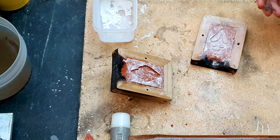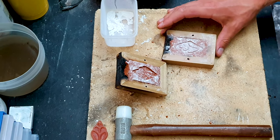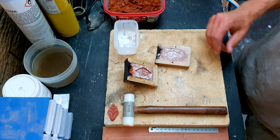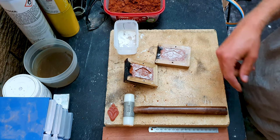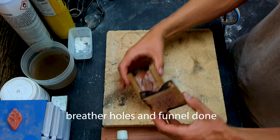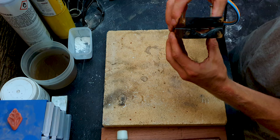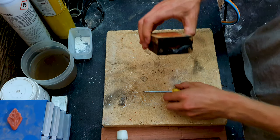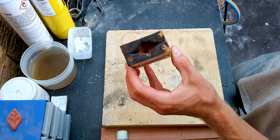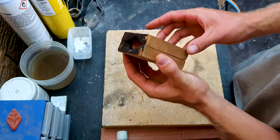The top end, put that over here — so that's my two halves of my mould. The next section is to put in my breather holes so that once it's poured in, the air has somewhere to go and it doesn't suffocate itself. Then a little funnel to be cut out at the top so it can be poured down from the top. Place these back together gently. You can see the little funnel hole and breathers on both sides.